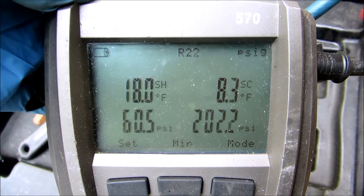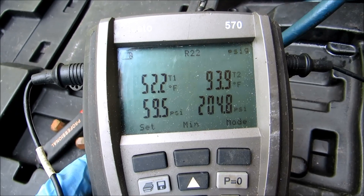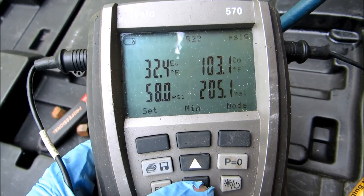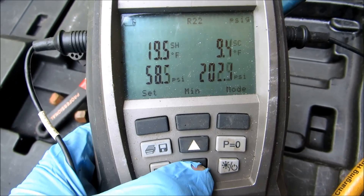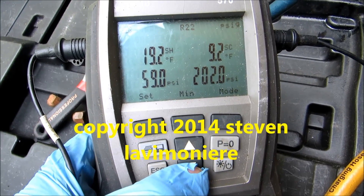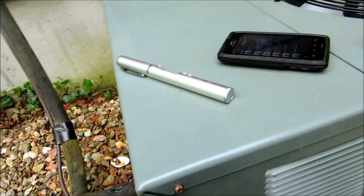Alright guys, I've got it pretty good — my subcool is around 9 or so, superheat's fine. Suction line coming back is about 52 — that's good. I'm a little low on my suction pressure at 58, but it's only got a 14-inch flex on the 2-ton unit — it's not enough return. That's why the suction pressure's low, and that's what it's going to get. I've got to get that copper clamp and come back. I've got to run the blue filters. I want to get a blue filter for it, then I'll run it and check it. I don't want to run that white filter.